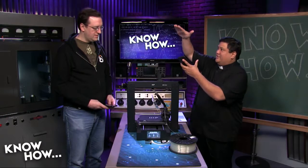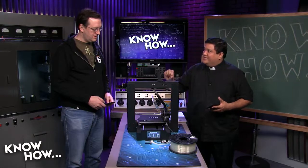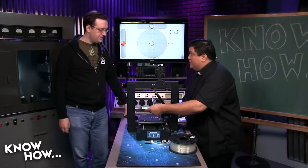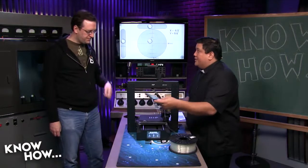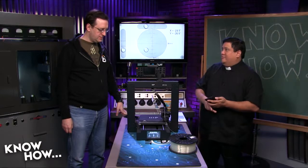What you'll get is the plate being skewed. You might notice that at some points you can't get the spring out enough, and at other points you can't get the spring down enough. So I'm going to put this phone on the crossbeam using a level app — we want the indicator to go red to show it's level. There's an adjustment point that lets me move it up or down. I'll go ahead and adjust it. There we go — it was about a degree off. That's important because if the head is moving at an angle, there's almost no bed angle that will be good for the filament.